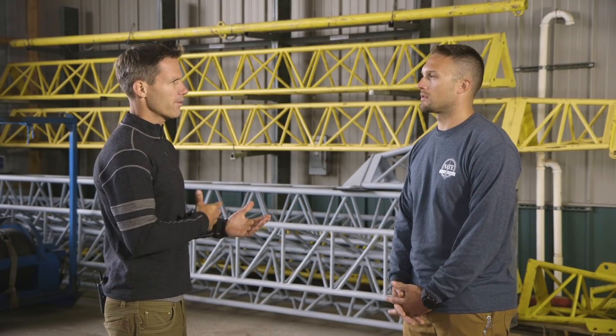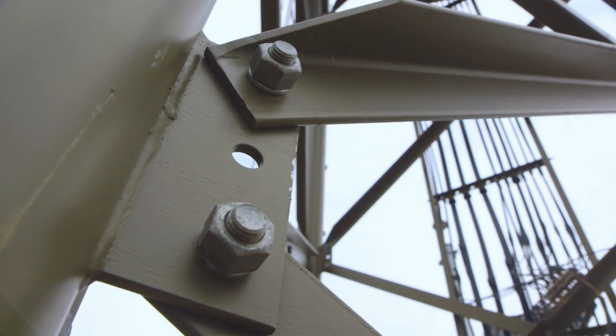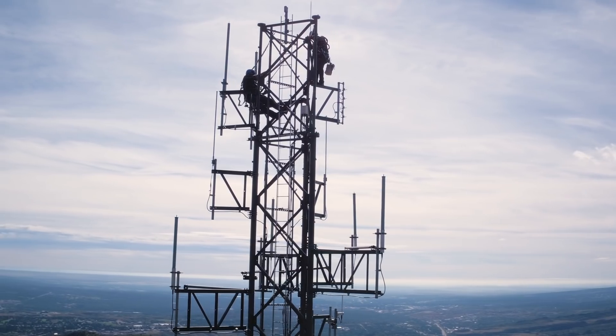So it's all about the proper sequence, right? Think of it even in terms of building blocks. When we're strengthening the tower, typically we perform modifications from the bottom up — start with the anchors and guy wires first, then the base. Work your way up and add or replace steel one section at a time, but always work in accordance with the rigging plan.